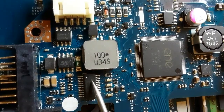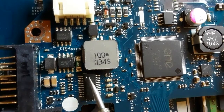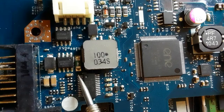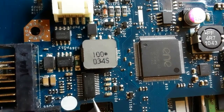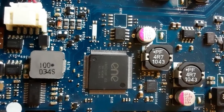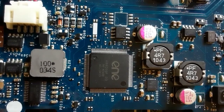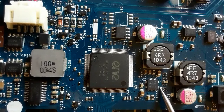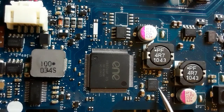Always the same working principle. For example, we have this dot here — means this is pin number one — and this is the direction of reading: counterclockwise. We have this IC also — this is a power management IC, a 3 volt / 5 volt power management IC. We have the dot here and the triangle mark, which means this is pin number one.